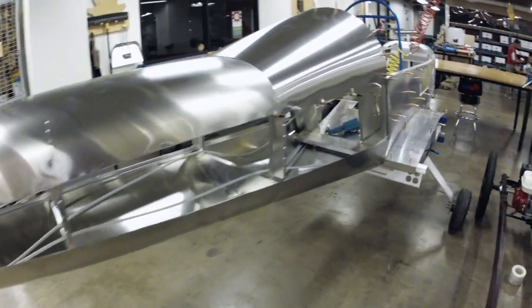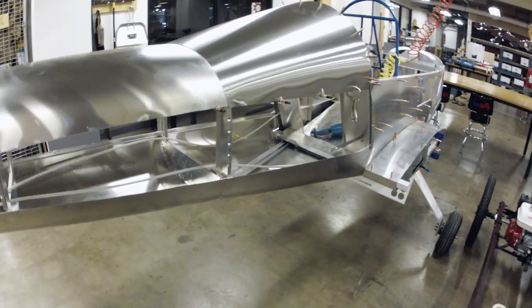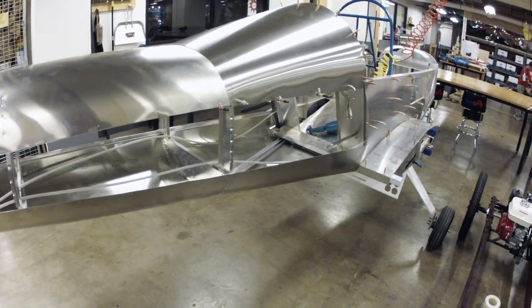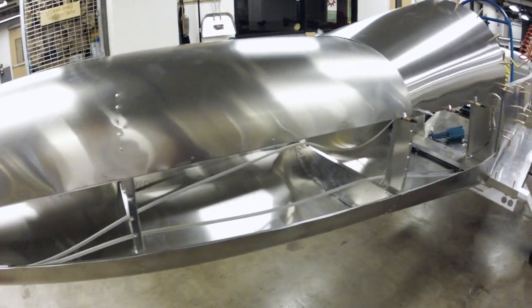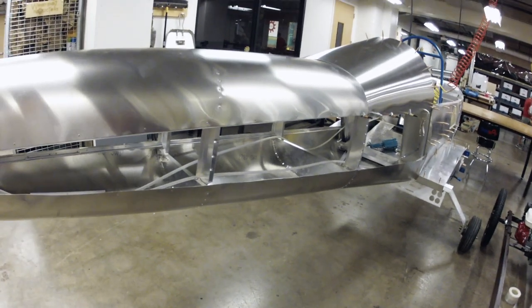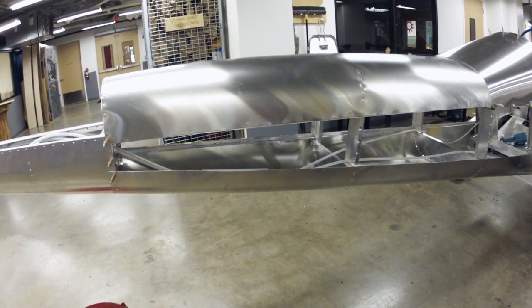This is going to have to be about nine feet long. As you know, Dave tried to spec everything for eight feet or less, except for a couple of sheet metal goods. He did put a splice in here - there is going to be a splice when the rod runs back through here through the FMN 10 bearings. You just slip a tube over it and you rivet it - four rivets on each side of the joint is what he did. And that gets you the length you need.